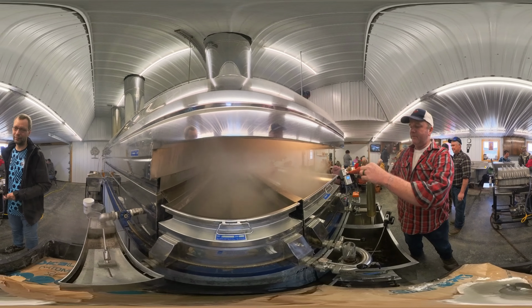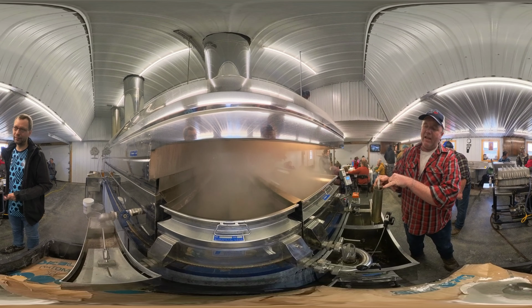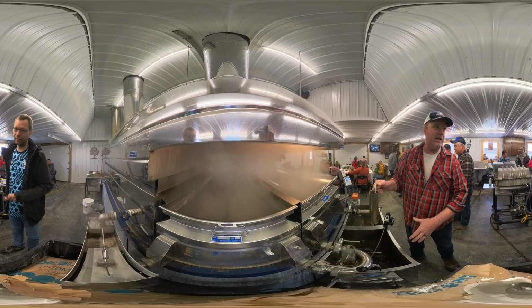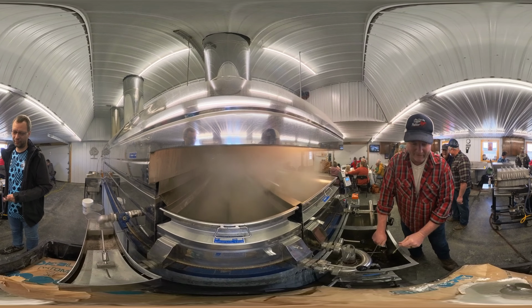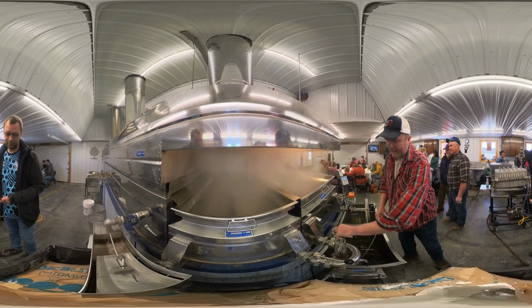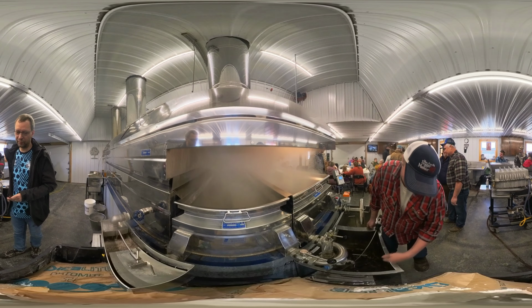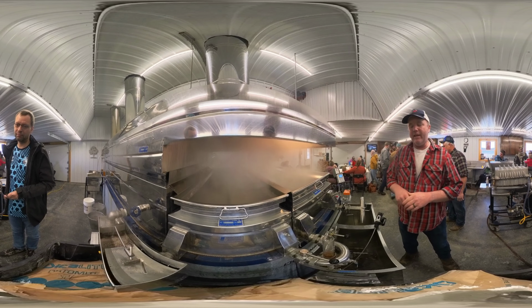So if we put that right in there, we'll see right now that by that hot line it's floating above it, which means that this syrup is actually a little too dense. So we've got about 1 point above our goal. That's easy to correct. We'll usually slide this tank over, add a little thinner sap to it, thin it down, blend it, check it again.